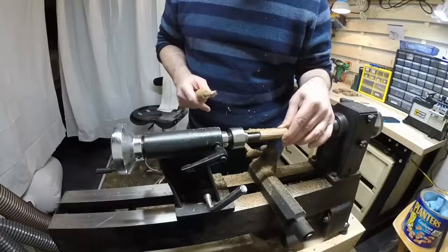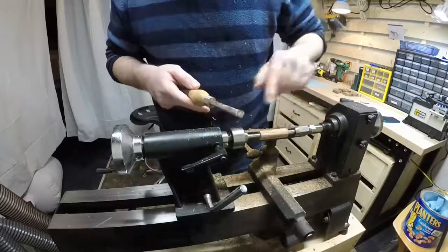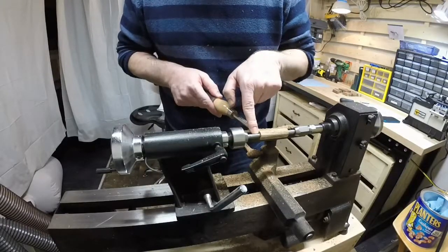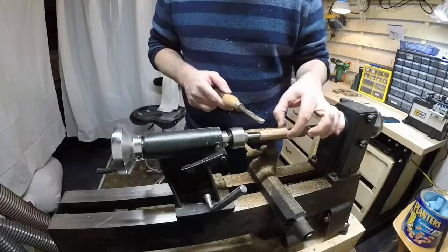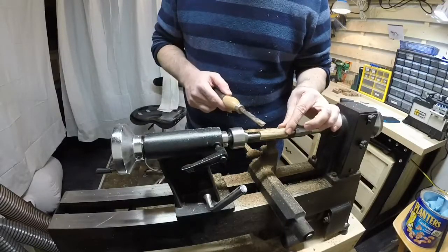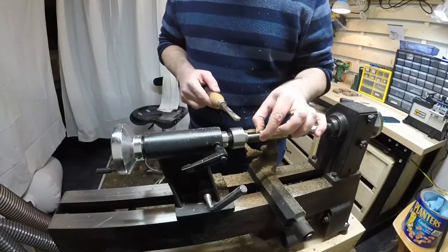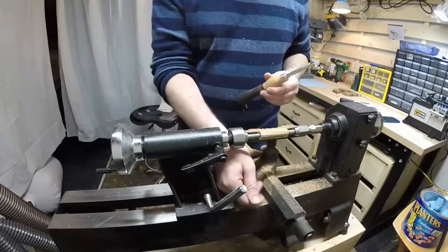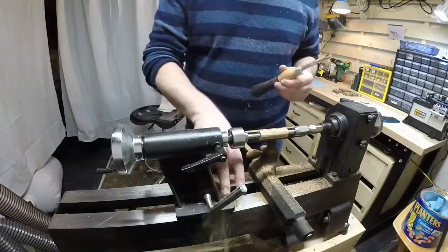Pause here, and you can see this has come down quite a bit already. What I want to do tonight is take these ends and get them down to about the thickness of the bushings here. Since this is the center band, I want to make this pen tapered a little bit. So this side will go down to the center band, this will go down to the center band, but I'm going to leave some size in the middle here for the pen shape for this one.